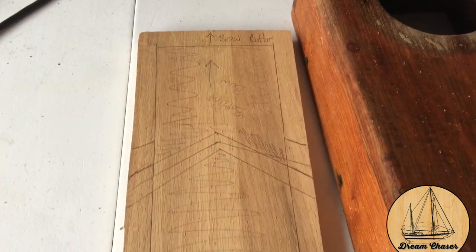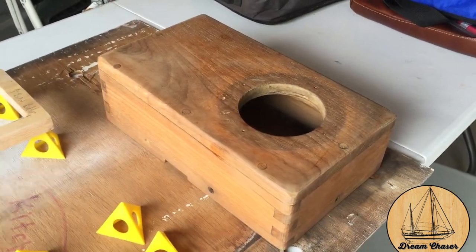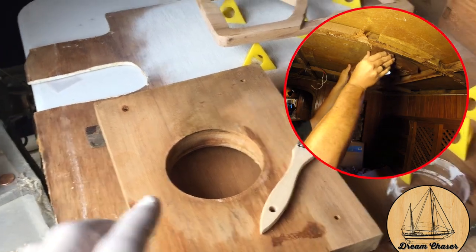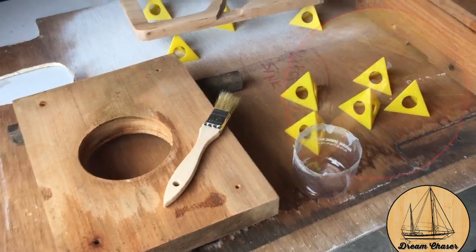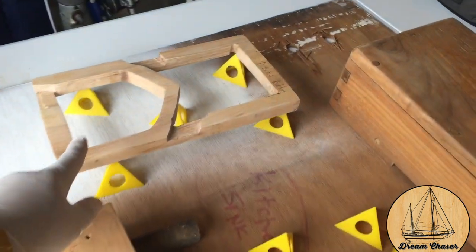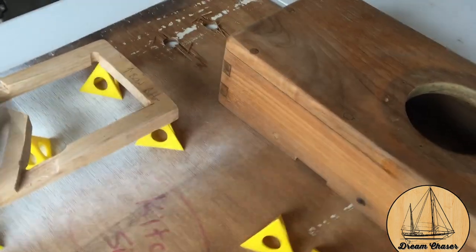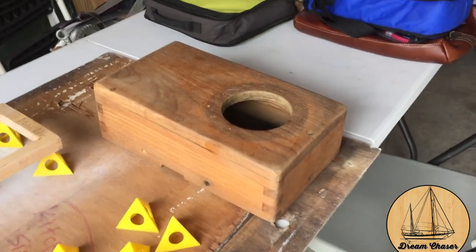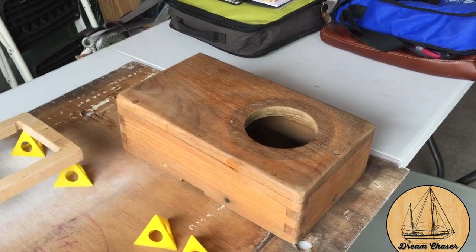Time to drill a few holes and cut out the center. We have the base made out of solid oak, the refinished Dorado box, and this is actually a spacer that goes between the fiberglass interior ceiling and the drop ceiling — it helps provide the space required for the Dorado tube that goes down into the cabin. So I'm going to mix up a little bit of epoxy and put a couple of layers specifically on the base because I want that to essentially be waterproofed. That's going to mount down to the deck, and then the Dorado box will sit on it and be screwed into the sides. I'm also going to put a layer of epoxy on the Dorado box rather than varnish — a couple of thin layers, and then ultimately we'll put varnish over it for UV protection.